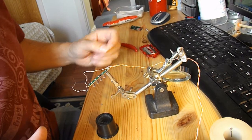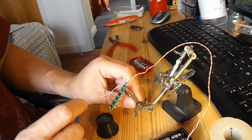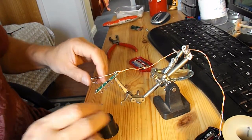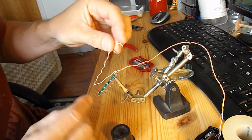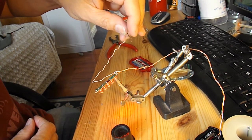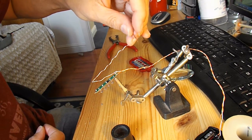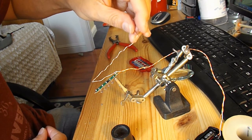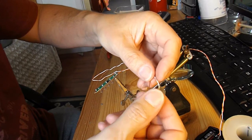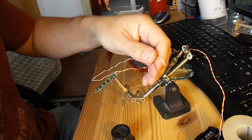Okay, just so I can keep track of what I'm doing, I've taken this apart now. That's the LED strip with the circuit on the back. I've run some wires around just so I can keep that separate, and I've brought these wires out from where the push switch would be. So all I need to do now is touch those together, switches it on, touch them together again, first cycle, second cycle, third cycle, and off again. So now these two wires are the ones that I want to include in some sort of sound activated or motion sensor. So see what we can do.